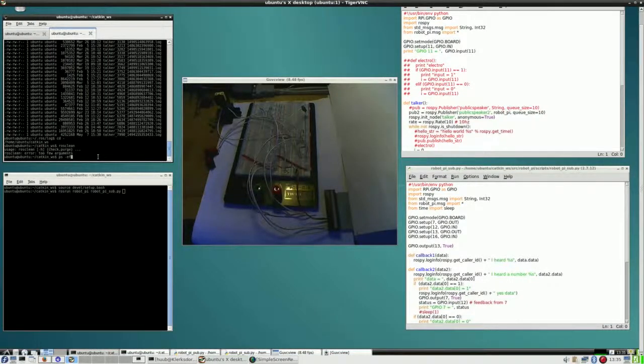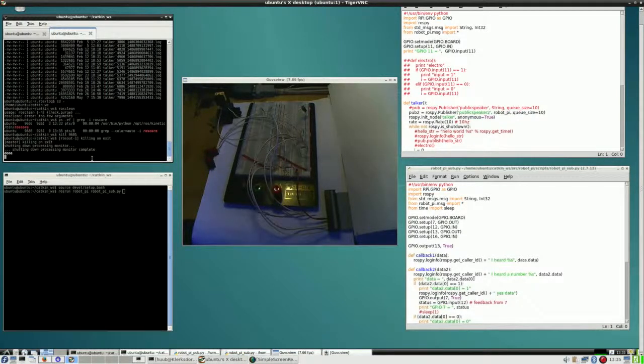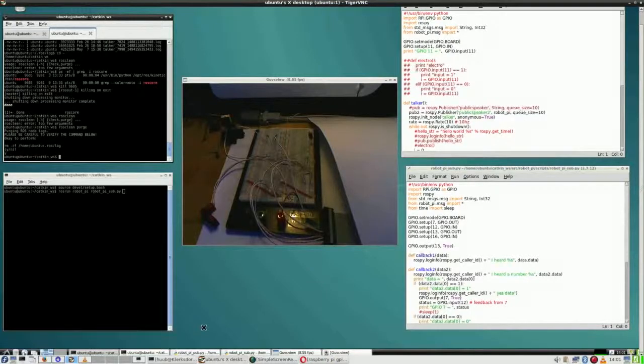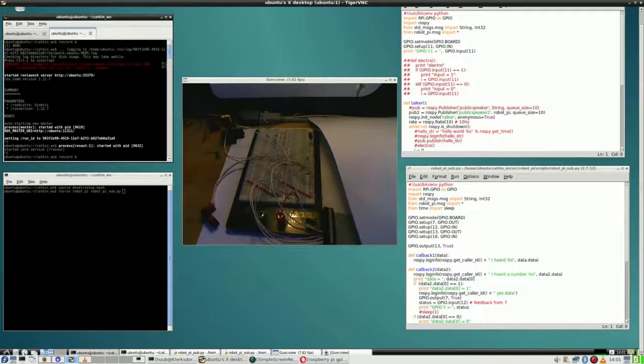Do I have roscore running? I don't think so. Yes, I actually do. So this is roscore running. 9605 is the process. Kill. So now it is done. Then I say rosclean. Too few arguments. Alright. I have to check on this. Alright. With the command rosclean purge, I did purge the log file. And I am getting back to what I did just a bit ago.